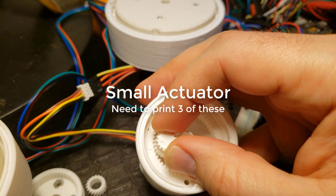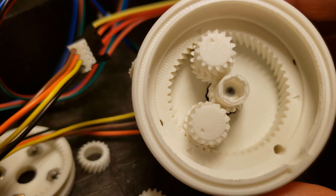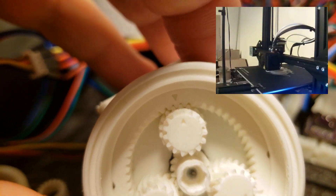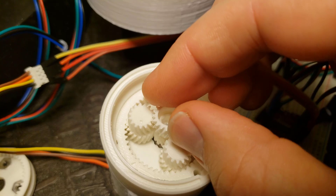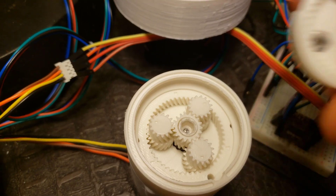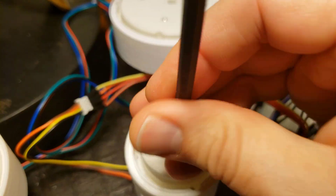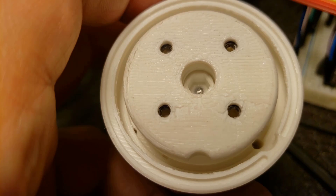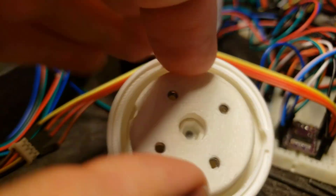Here's the small actuator — these are the most detailed. I printed them with a 0.3mm nozzle instead of the 0.4mm nozzle; the one I'm showing was on a 0.4mm but my subsequent two were on 0.3mm and those were much nicer to work with. The 0.4mm version required a lot of filing to fit correctly. These are much smaller, much more detailed, finer work. The nice thing is there's a center shaft you can put an allen key into for breaking in — I almost wish the other actuators had that design, it really helped with the break-in process.